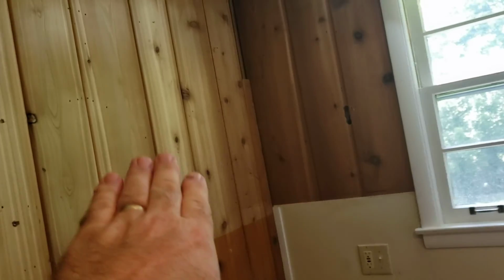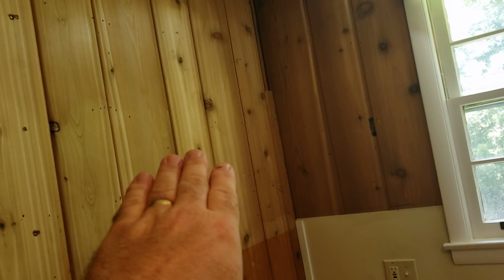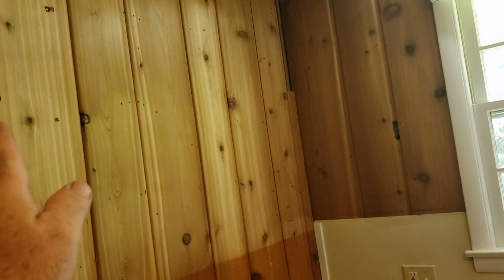That being said, when we look at the layout of the upper cabinets, we're going to take this 27-inch wall cabinet here, the 2739, pull it as far as we can up against the other cabinet, and we're going to add a center stile to that 2739 and reverse the door to where it will open to the inside like that to the right, and that will give us a wall blind corner 2730.